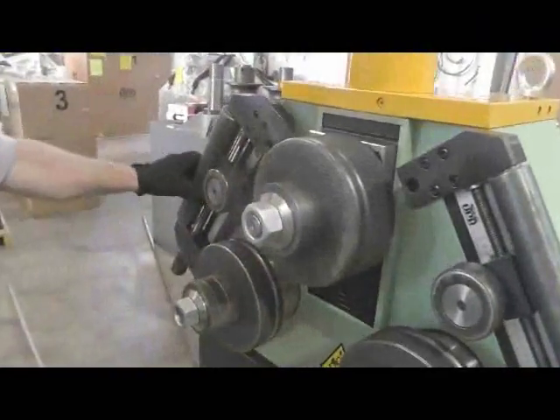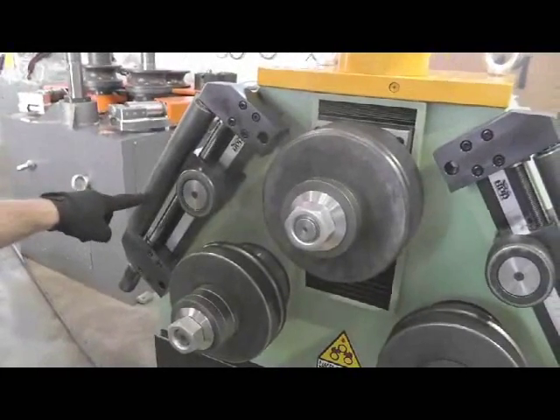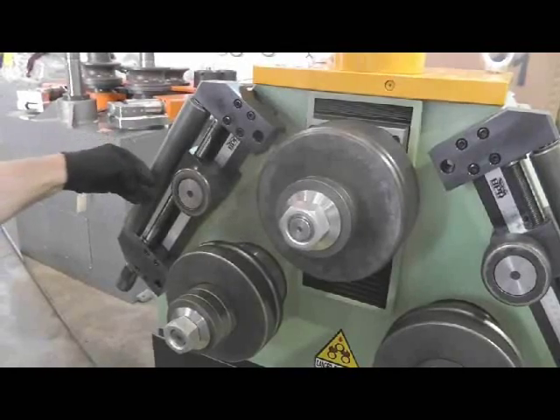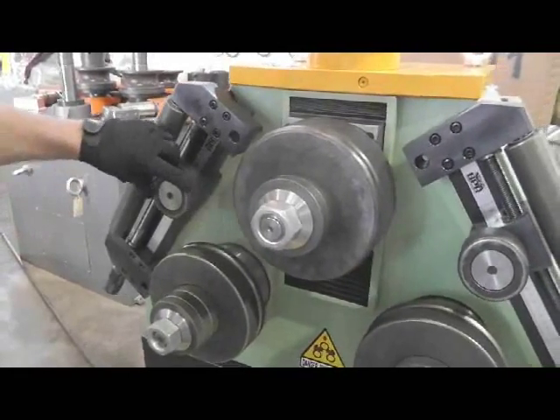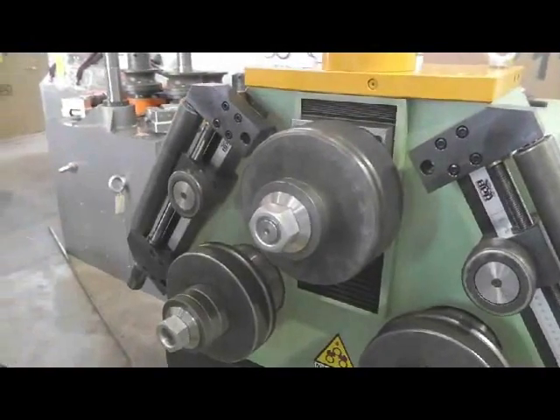The long rollers are used to help guide the angle through the machine and to keep angle leg in from kicking back toward the machine. We'll be pushing out with these — these are cam rollers. The angle wants to corkscrew, so we'll be pulling down on the perpendicular leg of the angle to control for twist.